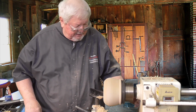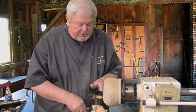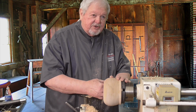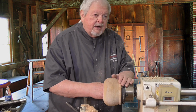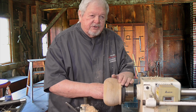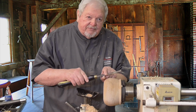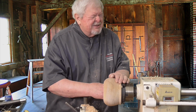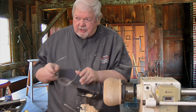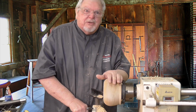What I've been working at is taking the little mountain out of the center. If you miss the center at all, you'll cut above or below it, and that leaves a little mountain in there, and it's almost impossible to get a round tool on a round spot. I've got most of it, but what you do is you feel for it, then get down underneath, come up like this until you get it flat, and then that makes it a little easier. Shape's still a little thick down here, but we're getting real close. We're getting closer. And when I look in there, it looks okay.